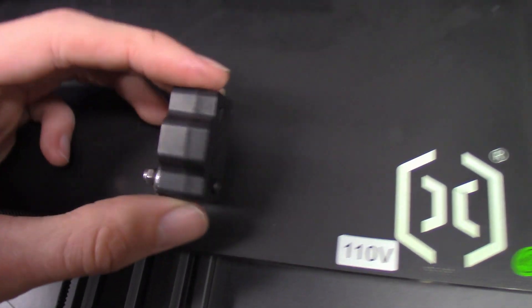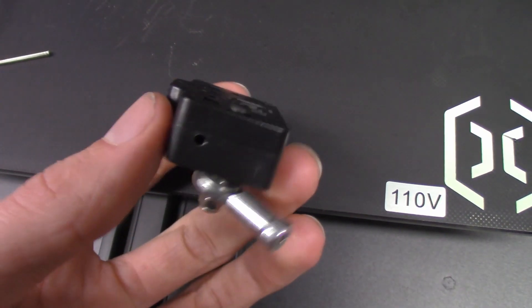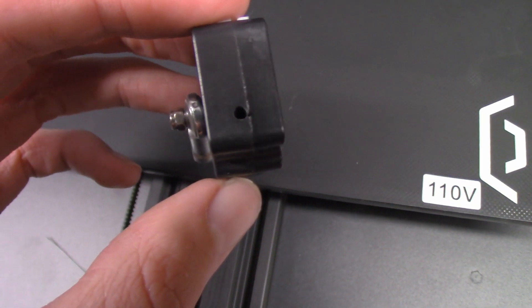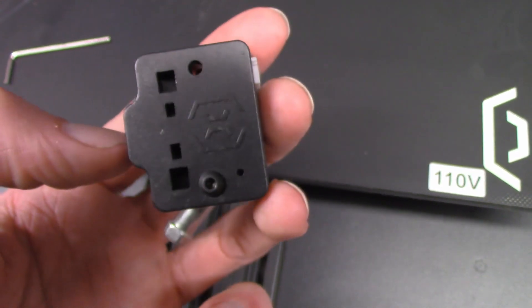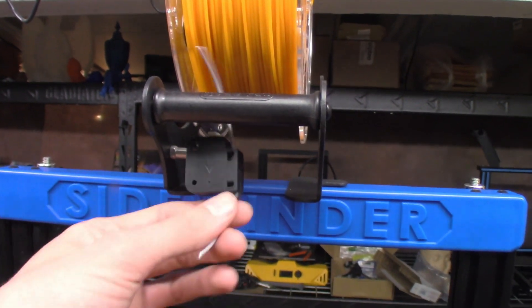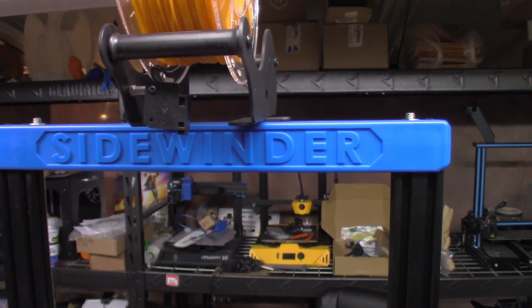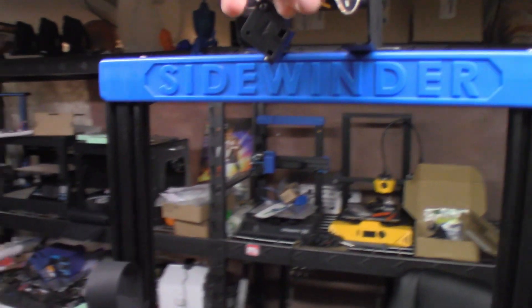If I come down here to the original sensor, I suspect there might be a little bit of flash or something on the holes, so it would actually be very easy to just carefully drill that out to a larger size. I'm by no means saying the filament runout sensor is bad — I just think there's a little bit of something making the hole too tiny. I should also note that I had the machine off while I was doing that. It probably wouldn't kill anything to do it with the machine on, but better safe than sorry.